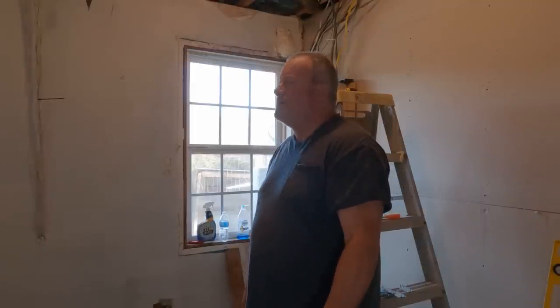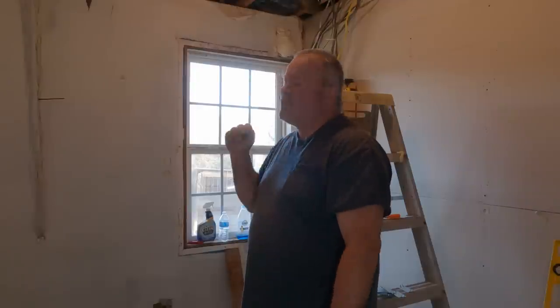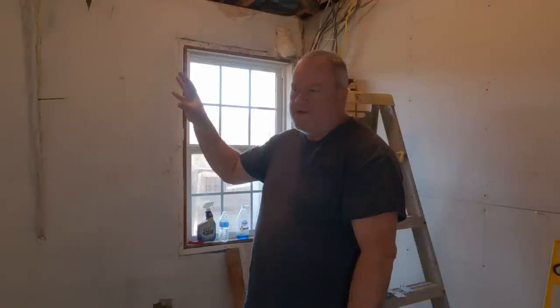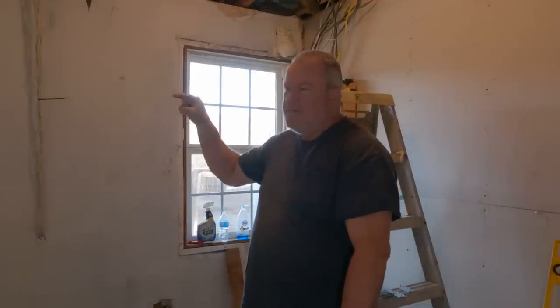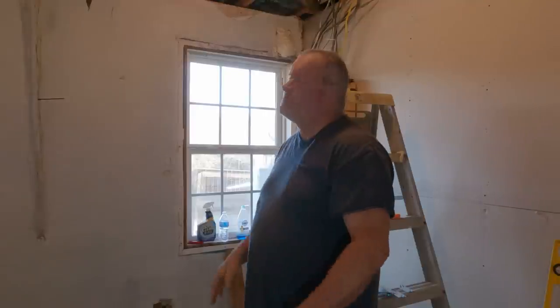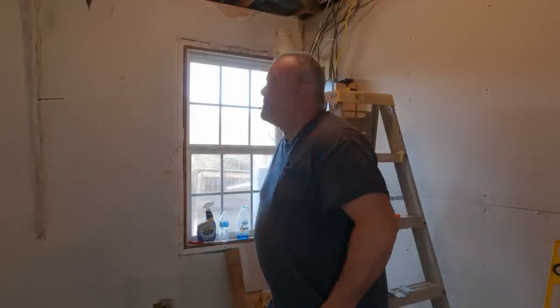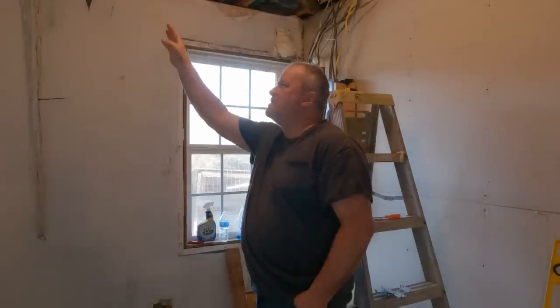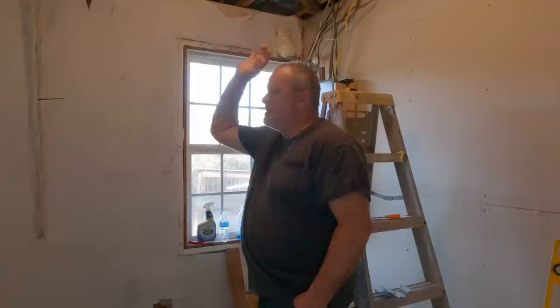Because it's on its way out. I'm going to look at it. I think where I went wrong is when I went in that junction box. When I made that junction box, I did not ground it to that box. Who knows, but there could have been a nick in that old wire that I had. But I'm buying brand new wire. We're going to run it separate from the rest of that stuff. And I'm not going to do that today.